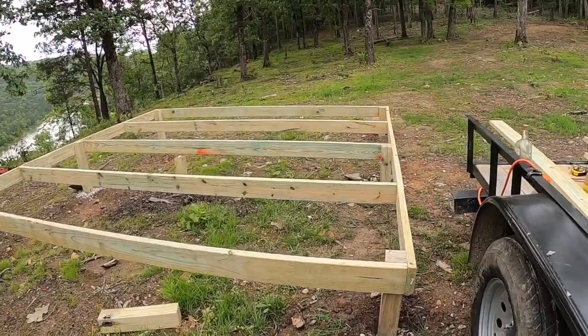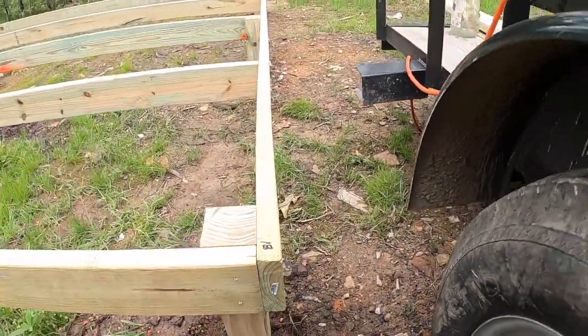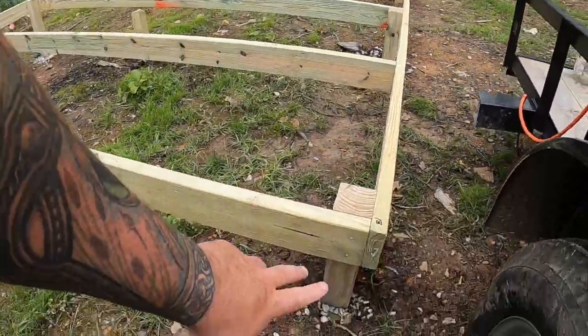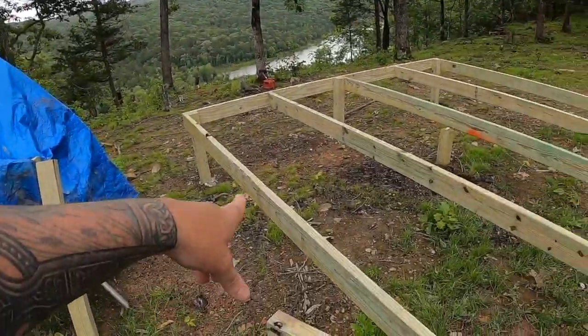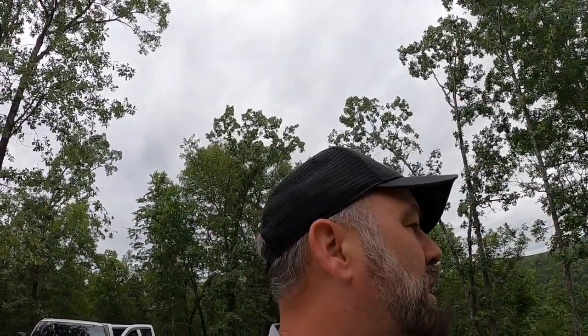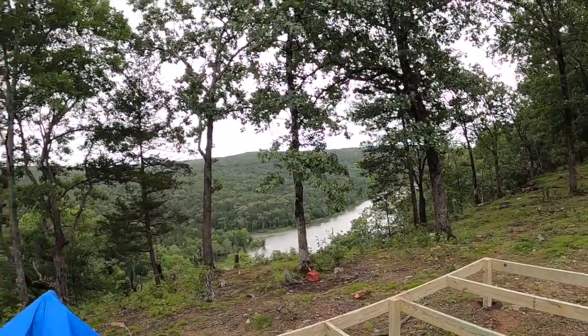I'm pretty sure I was so tired yesterday I did a really bad job of explaining what I was doing with this deck. So I assembled it flat, and then I did this side first — I've only put two 3-inch deck screws in each side of the post. I'm going to firm that up here in a minute, and also do braces through the middle. It sits a lot higher than what I thought, which is really good because from up here you see the river so much better.